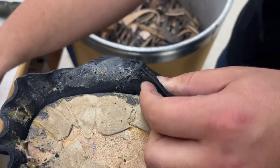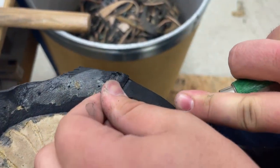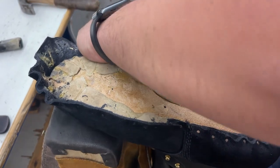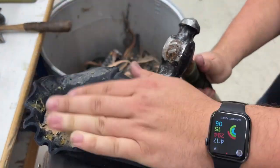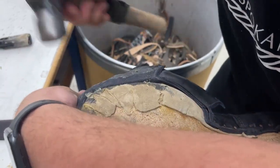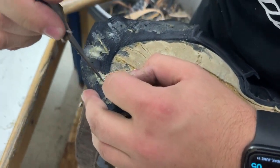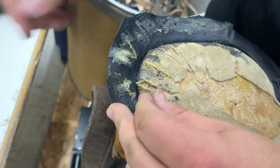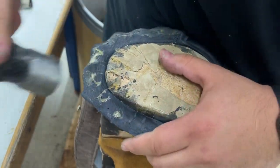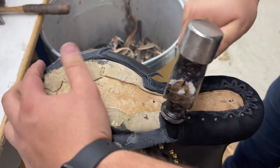With a lip knife I'm just going to trim the excess — a lot harder than it looks. Now I'm going to crown this — I'm going to come over here and hit it all the way around and really just crown this. Sometimes this adhesive can get stuck completely. I'll just trim that off and lay that back down, then hit all those tacks in. That's very good.